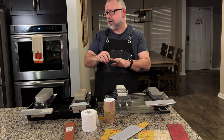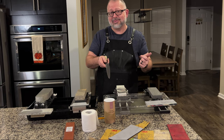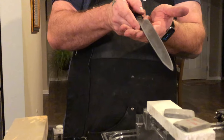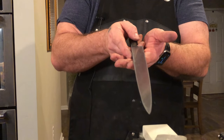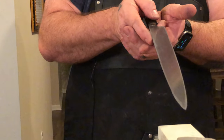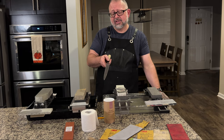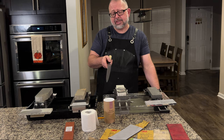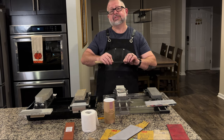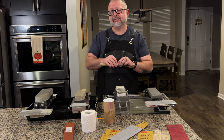In a different video we're going to talk about actually sharpening this knife, but one of the things that can happen is you get scratches inside the concave area. That area is called the uraoshi — the whole backside is called the ura. The uraoshi has its own grind, its own color and shading because it's ground in a different direction. Today I'm going to purposely scratch the backside of this knife and show you how to fix it.